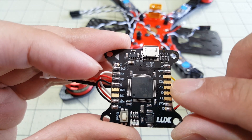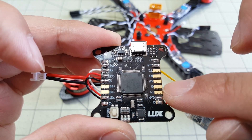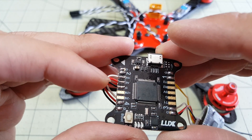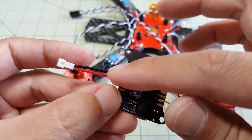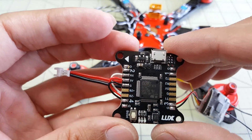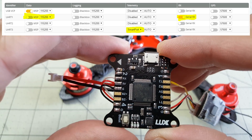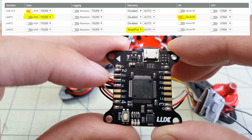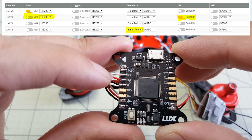The USB does not output 5V on the other 5V rails for the UART. I was hoping to have cables a little shorter coming out the back on those UARTs, but because it doesn't output 5V there I have to get it from over here, so the wires come out the front and wrap around to the back of the quad. Also be aware that these three pins are on UART1, but by default UART1 has MSP enabled, and you can't have serial RX and MSP enabled at the same time — they conflict. You need to disable MSP on UART1 and enable serial RX on UART1 to get this to work.